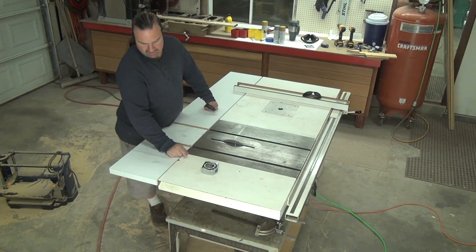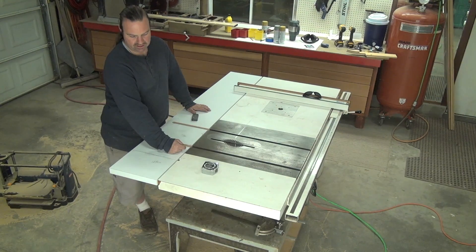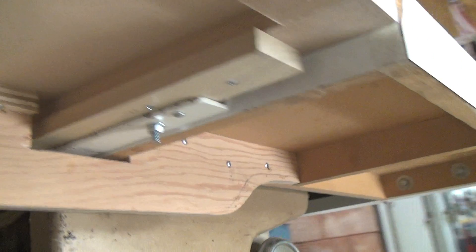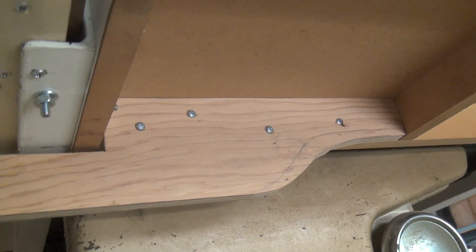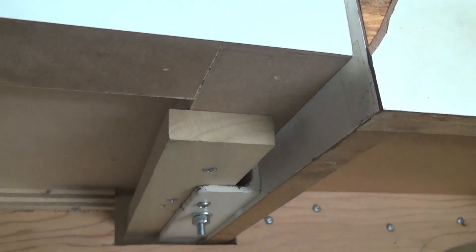It's white — not quite the same shade as this one, which has almost a blue tint, but I had it stored in the back shed. As far as how I attached it: because I had the Biesemeyer fence, it had some two-inch angle iron on the back, a quarter inch thick, so I was able to attach it to that. I didn't go too crazy reinforcing it with metal brackets — I just used some plywood brackets. Over here it's pretty much the same, except I did a small angled cut on this piece so it would match the saw. Here's the angle iron. I took some poplar, ripped it to two inches wide, and ran it through the planer so it's only a certain height — just slightly below the cast iron and the rest of the surface.